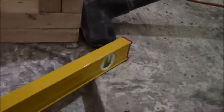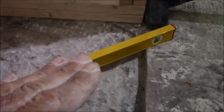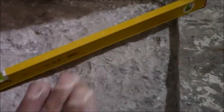You can do your measurement, which I already know what this is. Sitting right there on the slab, that will be the exterior tile. There's also going to be some thin set and tile on top of there, so there's probably another 1/4 inch rise that isn't accounted for quite yet, although that will be negated by the fact there'll be tile bumped up again. In fact, it'll be the large format tile that I'm using out here that I'm going to use in here at this range here, so there'll probably be about 4 tile going across, 4 and some change.